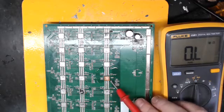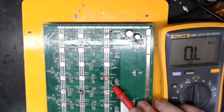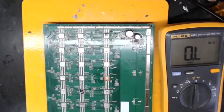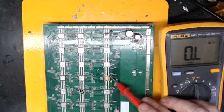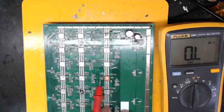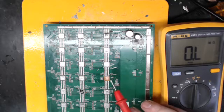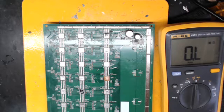I think I'm going to take the approach of pulling this chip up again and replacing it. Somewhere I missed something — I'm going to have to clean up the surface and repeat the process I showed you in the last video. I've seen some people take a little solder and add more on either side, so I might try that this time. I'm going to run some solder along either side, then reapply flux, then heat up the whole chip and see if the solder is drawn down under to meet it. So that's the process — thank you very much for watching.